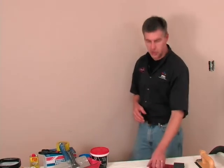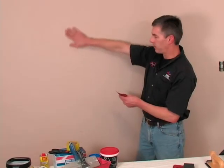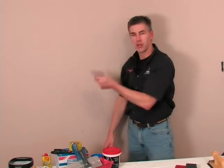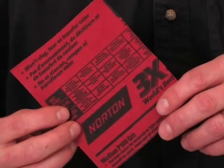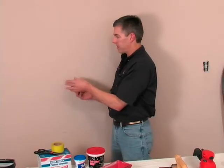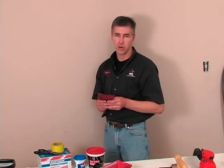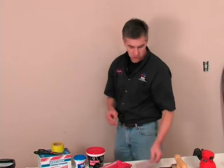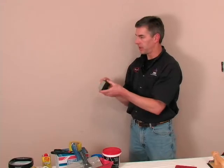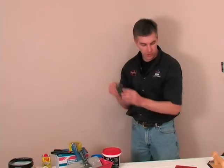We can do something as simple as a regular sheet of sandpaper in hand. We can feel the wall, find small imperfections and trash from the previous paint job, and just simply sand those off by hand. We like the Norton 3X sandpaper — this is a special abrasive designed not to gum or get sticky when sanding acrylic paints, which is a common problem especially when we get into our trim. We can also go to a sanding sponge that gives a little flexibility, which helps up around door jambs, edges, and corners, so you want a few of these.